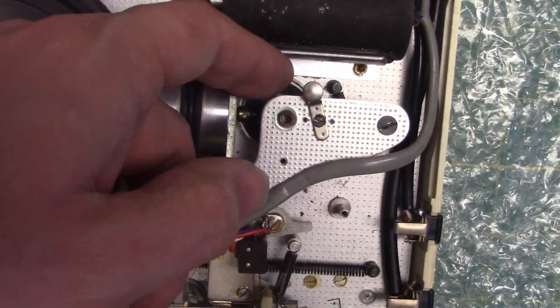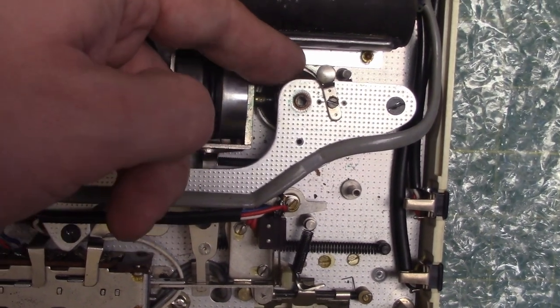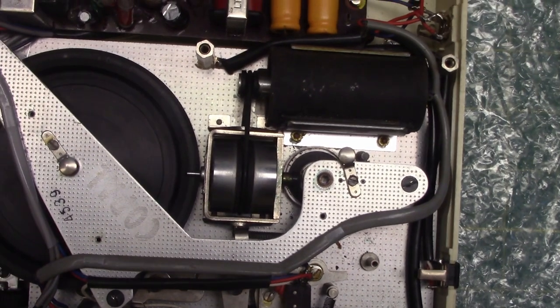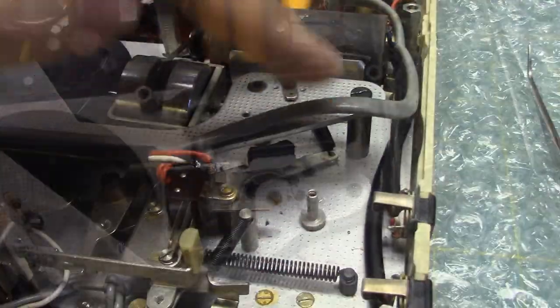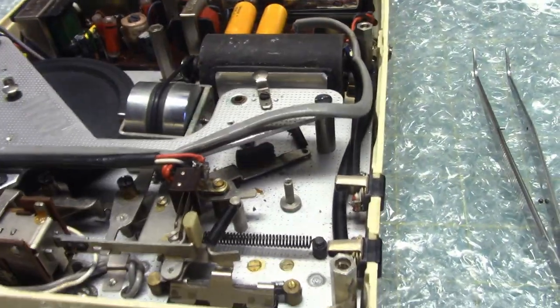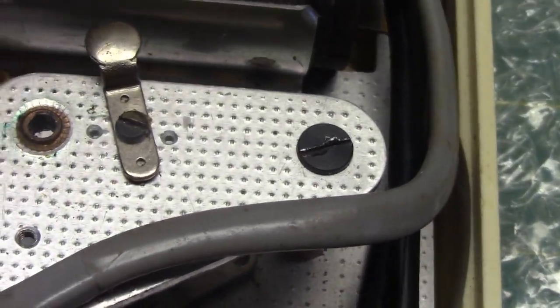I'm going to be adding a little round piece of rubber that I have, which was some other O-ring like thing that was in my late dad's old organizer drawers, because this little piece here was missing its old rubber, and that should fix the rewind, but I need to glue it in place. These bloomin' screws I can't take off. I tried. It won't budge. And I don't have a wide enough, thin enough flat blade screwdriver to fit in there.